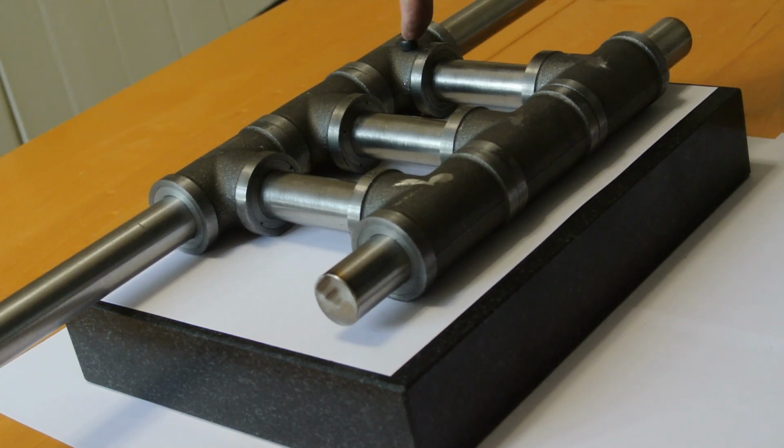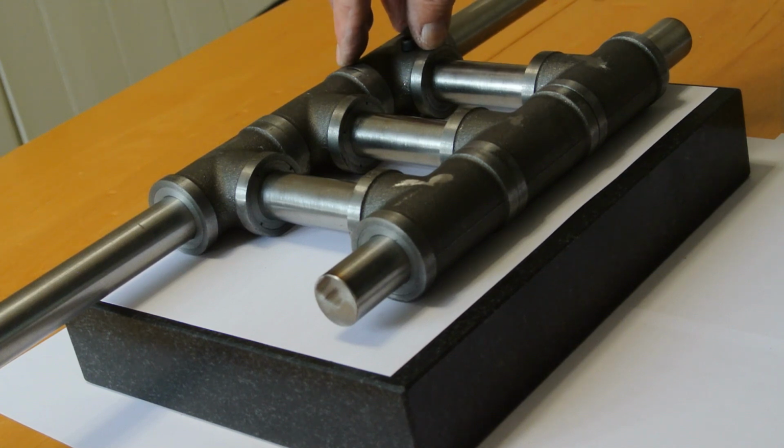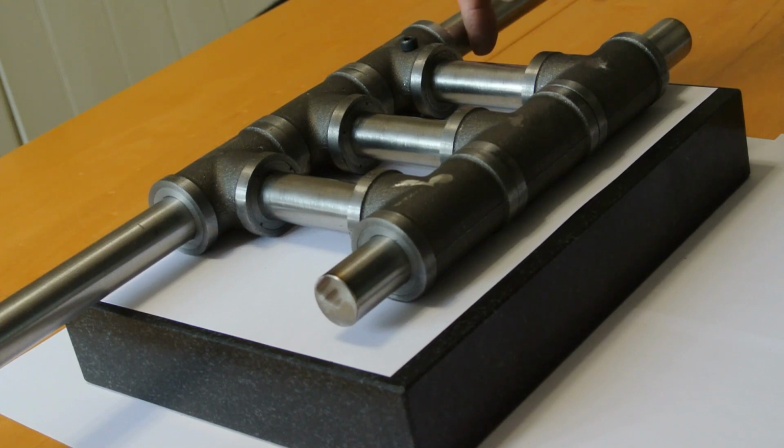The one problem I have got is drilling the hole. Drilling the hole through isn't a problem, and that's easy on the mill, because these 3 surfaces are locating the direction in which that goes, and I've centred off either side of this bar with the mill. Then that gives me that dimension, and I've centred off here, and that gives me 17mm from the centre of here back. That is where to drill the hole, and that's reasonably easy to do.